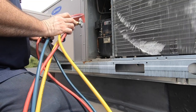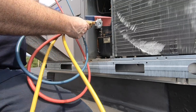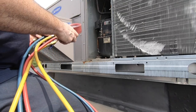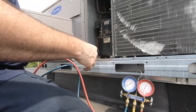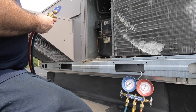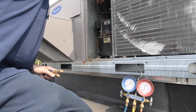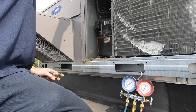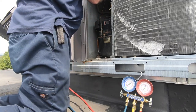We all do. Every gas, because I don't know if I've got R-22 or 410A in here, but all out. That's another mistake I'd probably make, but I don't believe there's enough oil in my hoses to contaminate a system. Unless I'm on a burnout or a really nasty system, I don't think I need to blow it out every time. I don't think I need different hoses or different gauges. I've been doing this 20 years.